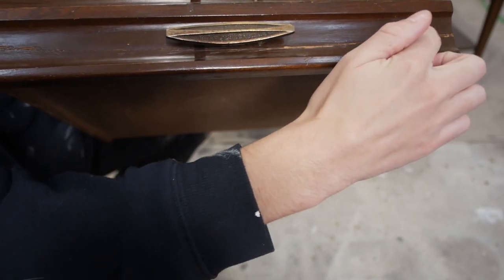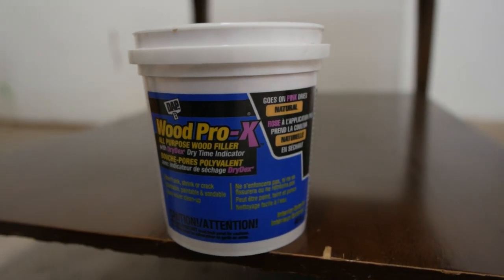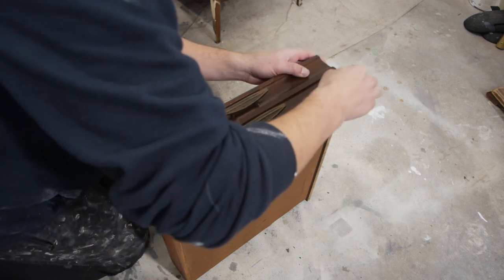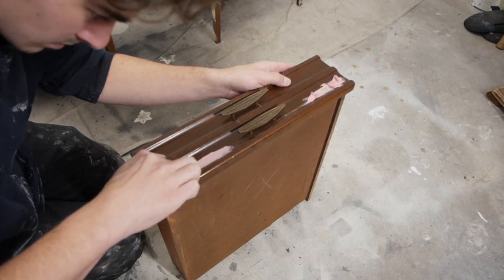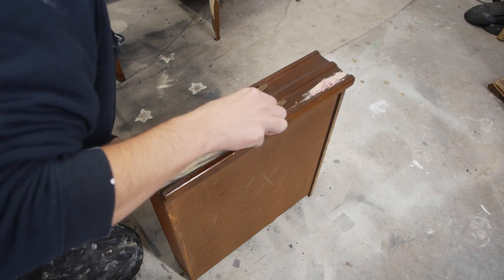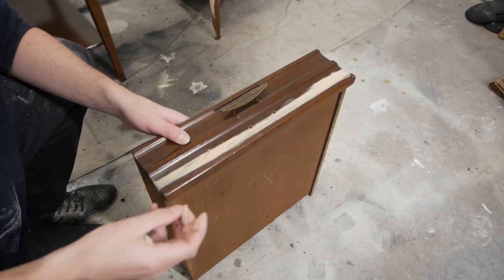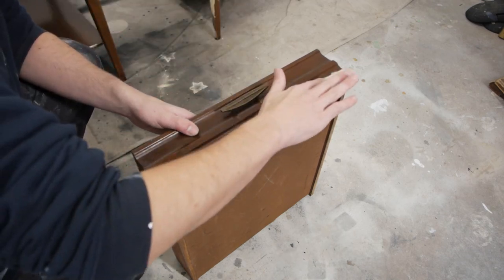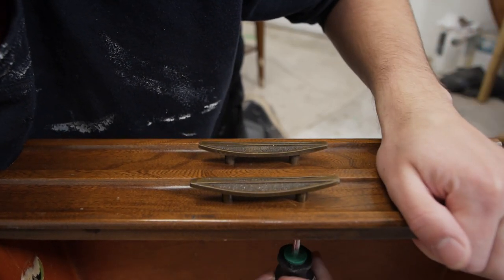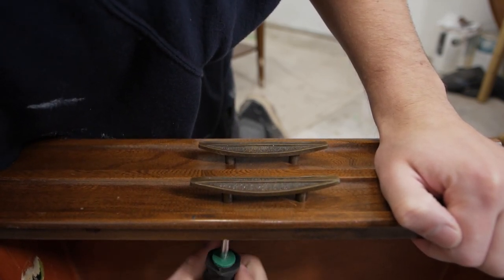Although we glued it solid, you can still see a big crack in the wood on the front of the drawer, so we need to fill that with some wood filler. I'll just dab some on my finger and rub it through nice and smooth. I forgot to move one of the drawer pulls, so let's get that out of the way. I usually wait overnight for the wood filler to dry before sanding — if you don't let it dry completely it's not going to sand well. So let's take off the other drawer pulls and keep going.